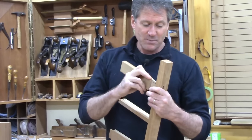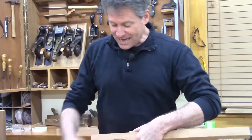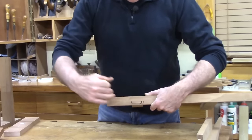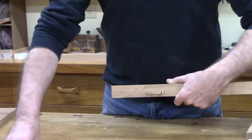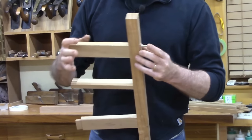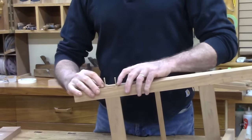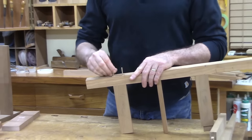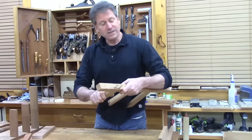This is another joint we do in the joinery essentials class. It goes in, slams up tight to the shoulder, and then you cut a couple slots to add wedges to it. You have to chisel a very slight long taper on the top and bottom of the exit side of the joint. With a little clamp pressure on the shoulder, you tap and drive the oak wedges home, spreading the top and bottom of that tenon to lock it in for good.